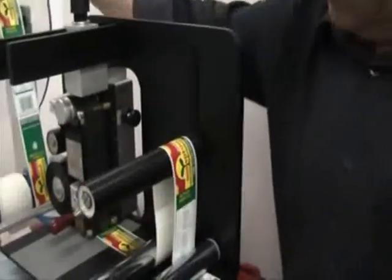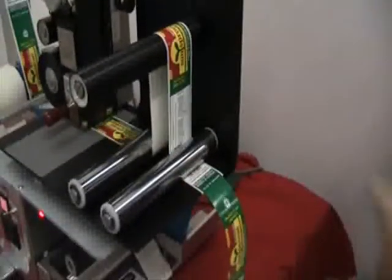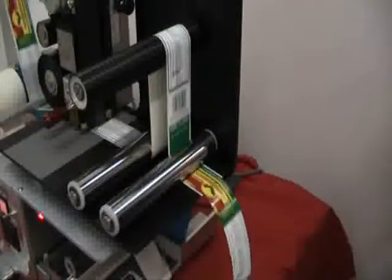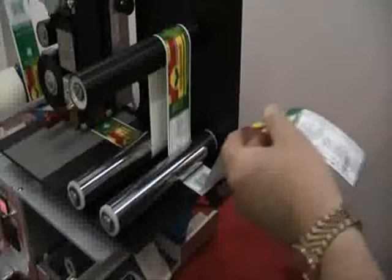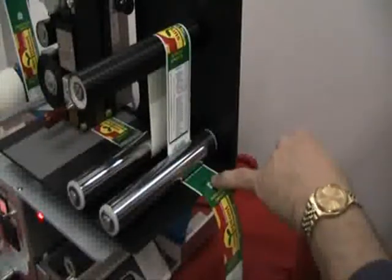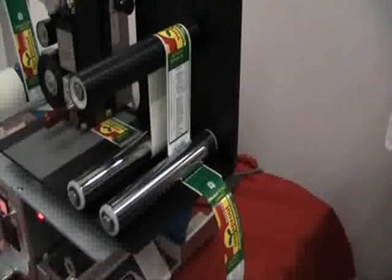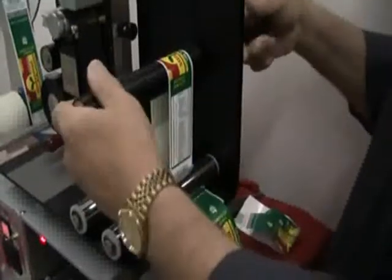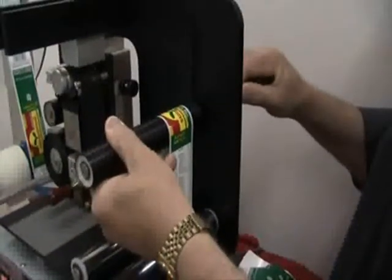And then I pull this spool back. I will print one label and see how much it's moved, noticing that the label feeds out the same amount. Now, here's where we've moved the code by moving that roller. If I drop that roller just a little bit more, or bring it up just a wee bit, it should bring it right in that position.